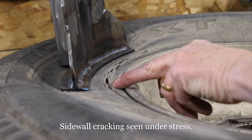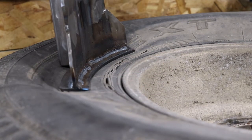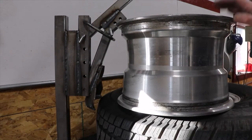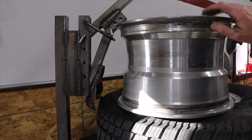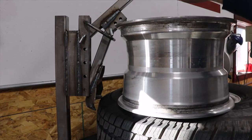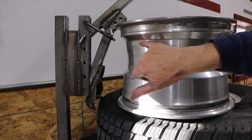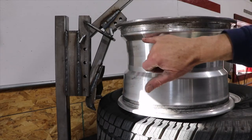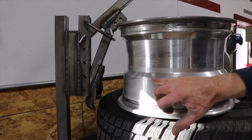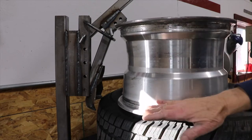You can see all the cracking here and that's throughout the tire. This is one of the wheels I pulled the tire off of earlier. This is the outside bead — the bead that you would see, the edge of the tire. You can see how this bead to the drop center is just a short distance. When you come down here to the back bead across the safety bead, it's a long way down. So this one has always been easier to break than this one here.